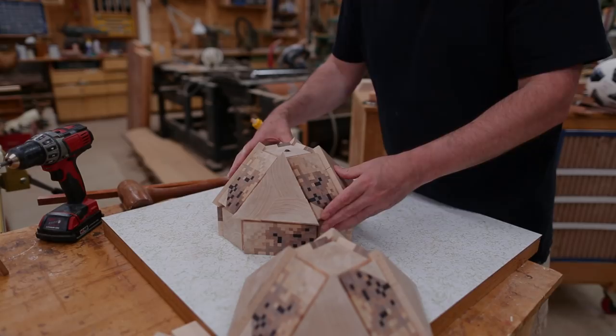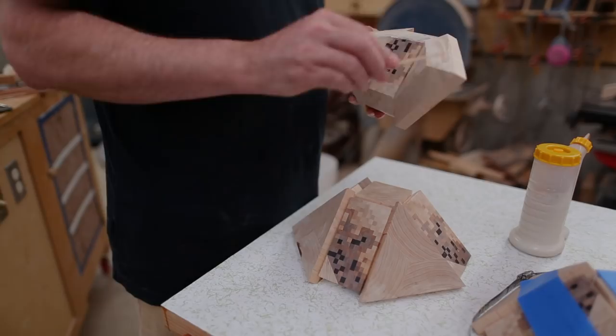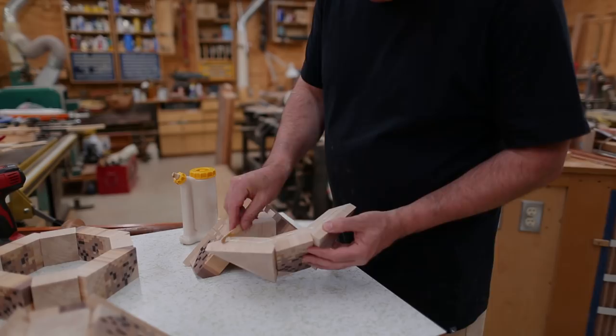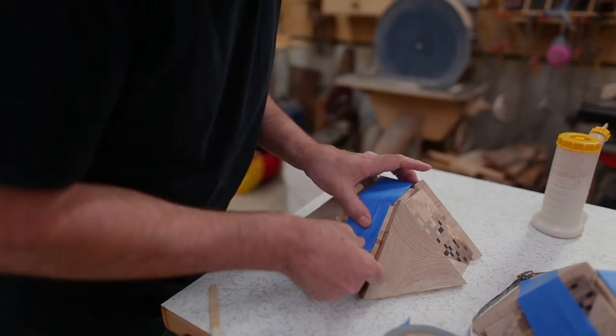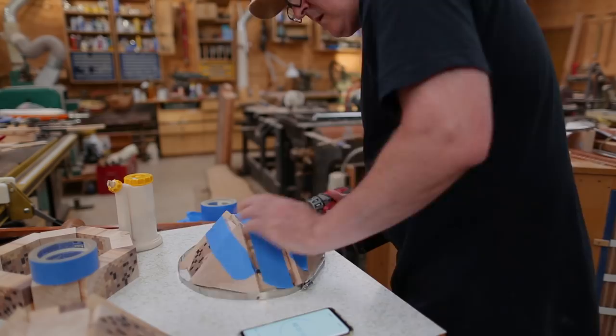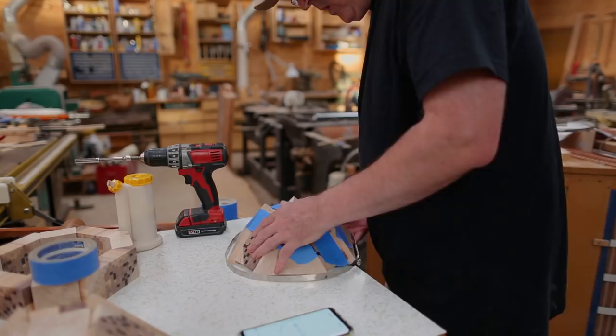Now I can make sure my pattern's right, and I can glue two of the quadrants to part of the second ring — I need to do this for each side of the sphere. This means I'm just gluing up two flat glue joints and I can keep those perfectly tight this way. I was going to just hold it, and then I realized I could use tape — so I taped the top as tight as I could get it and put a ring around the base. That held it pretty well, because the two surfaces are nice and flat so it doesn't need a huge amount of pressure, just needs to be held in place.